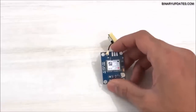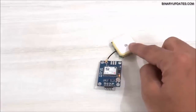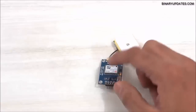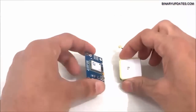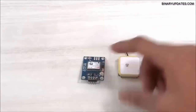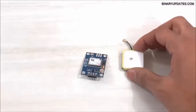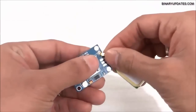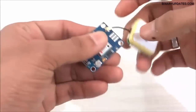What we see here is a very popular u-blox NEO-6M GPS module which comes with a patch antenna. When you buy this device you usually get these two components together, but they come separate. You have a patch antenna and a NEO-6M GPS module, and you can easily connect the patch antenna to the NEO-6M module by hooking it up to the UFL connector.